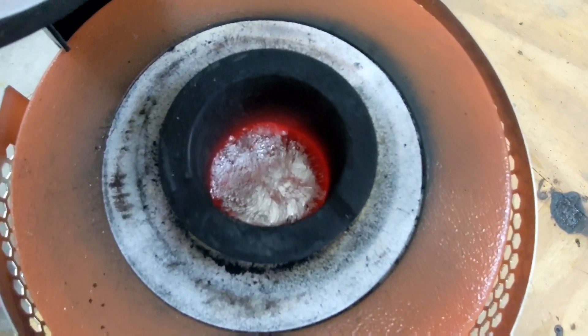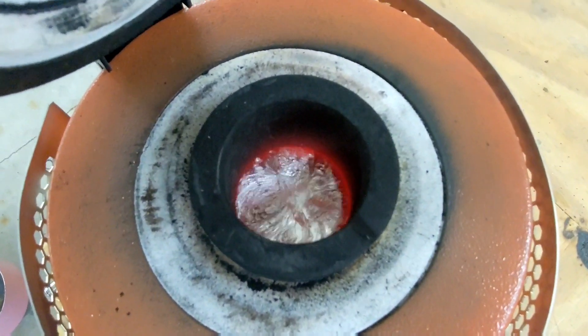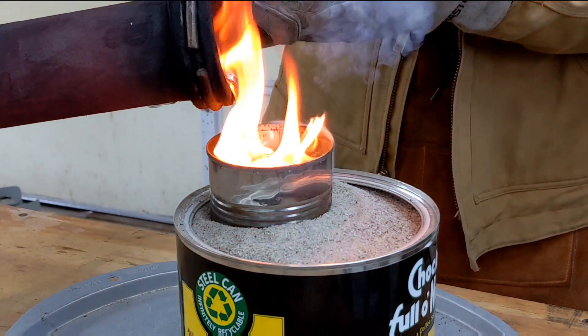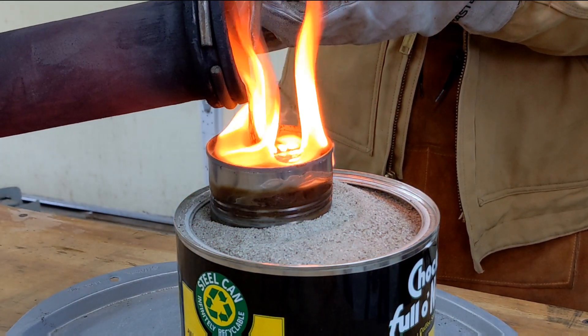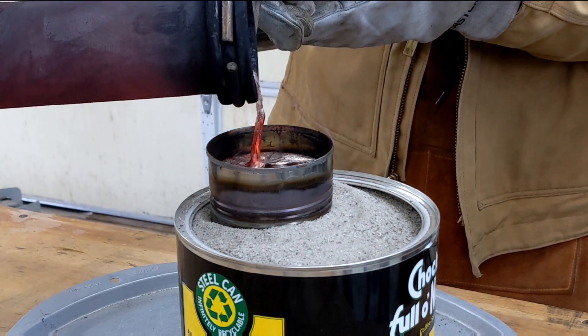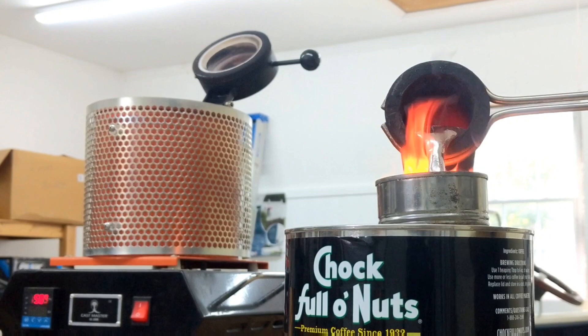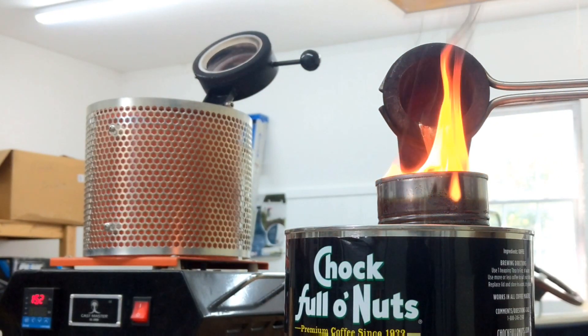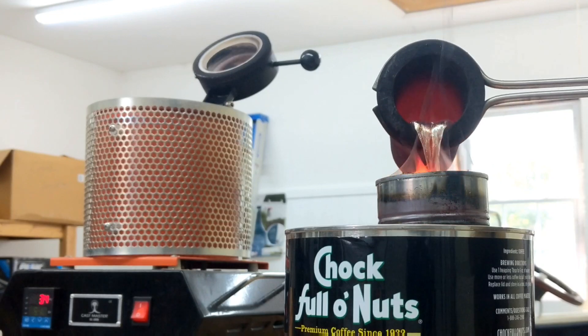Let's check to see if the aluminum is ready to pour. This is where the conversion happens. When we pour molten aluminum into the basin, it starts to vaporize the foam and the molten aluminum rushes in to take its place. It happens very quickly, so you will need to pour fast enough to keep the basin full, but also know when to stop.